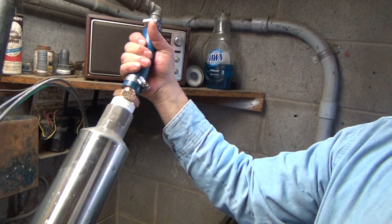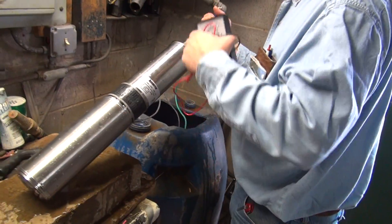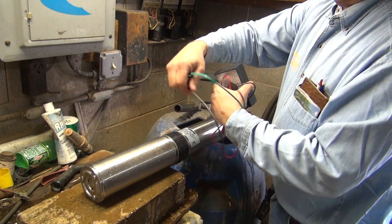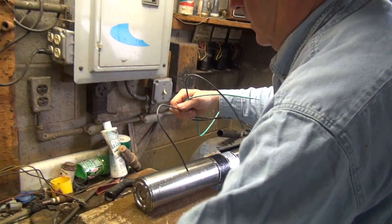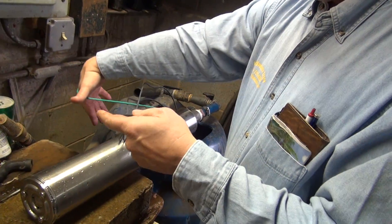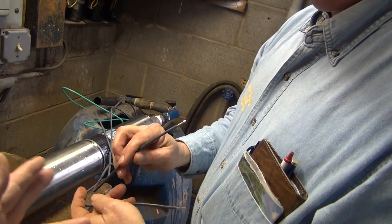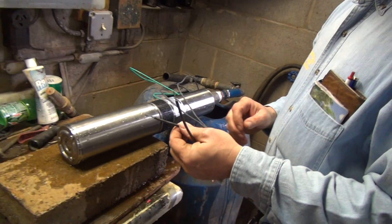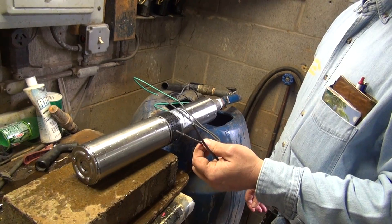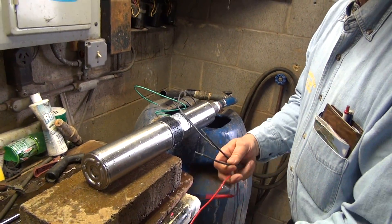All pumps come with wires attached to the motor. This is called a two-wire pump — even though it has three wires, the ground wire doesn't count. The original pumps came with just two wires; these have two black wires and a green wire. Green is standard for ground. It doesn't matter which wire you hook up to the electric current. Now, it's a 220-volt pump, so you're getting 110 from each side of your box. How come 220 requires two wires here, but in my home 220 requires three wires?